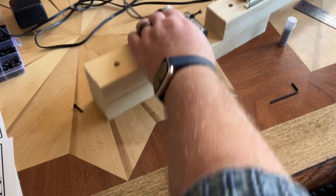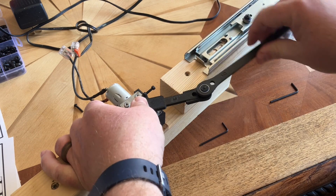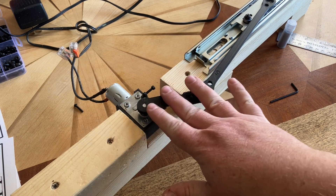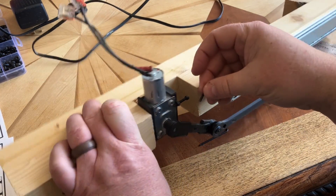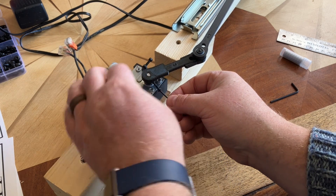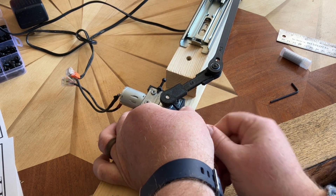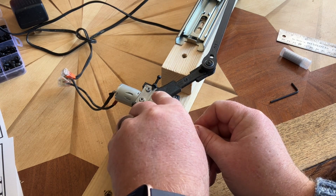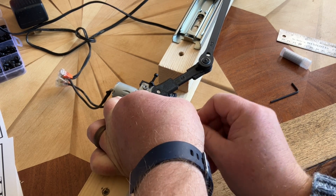Once we've got to this point, we're going to take our motor, find that index, line it up and push it all the way down — that'll get it hooked on. You'll see how the shaft comes to the outside. If it goes to the inside, it'll bind when it comes around, so whenever you're dealing with shafts like this, you want to make sure you're building out rather than in. You're going to find your M3 16mm bolt. On that shaft, you'll see there's a spot for a bolt — this is so important because it takes up the load of that keyed index. Make sure before you test this thing that everything goes together. What happens is the flat of the drive shaft hits up against the bolt when it torques up, so it takes the weight and doesn't strip out the plastic. If you don't put this bolt in, you're going to end up with bigger problems.